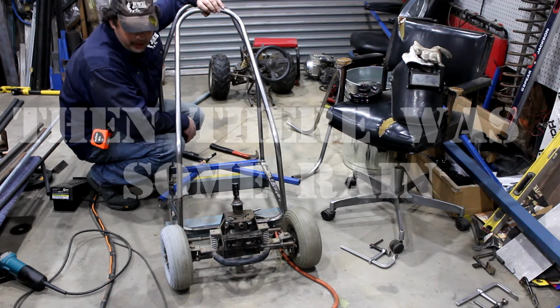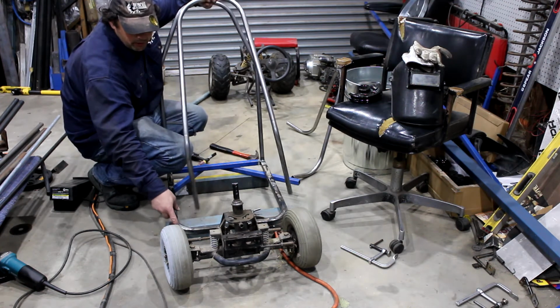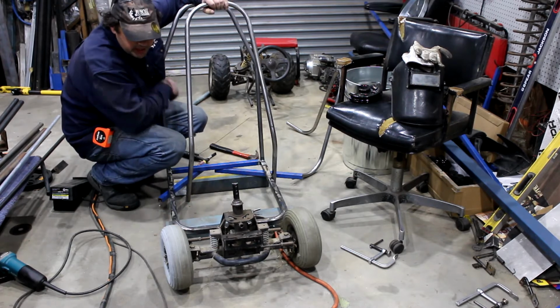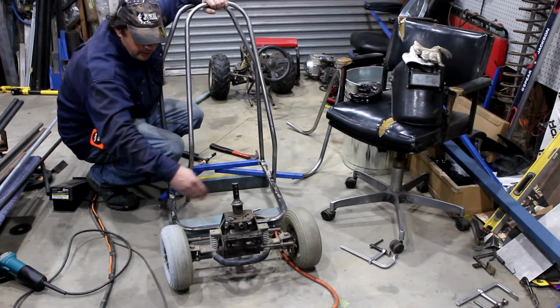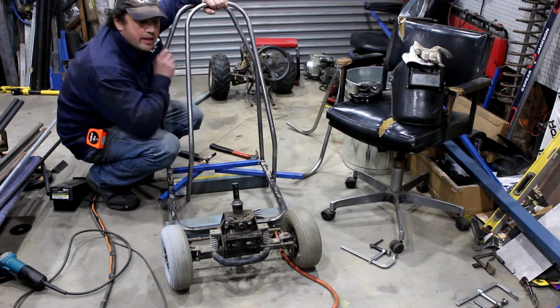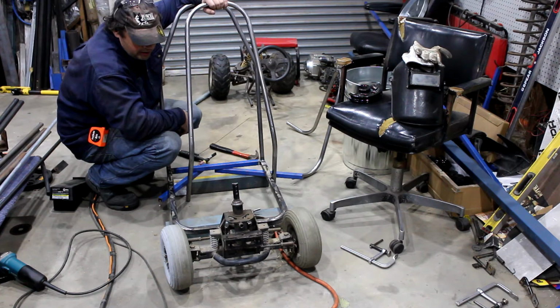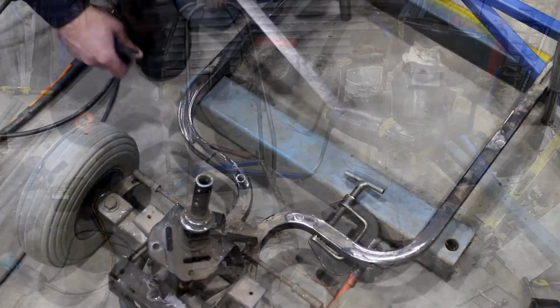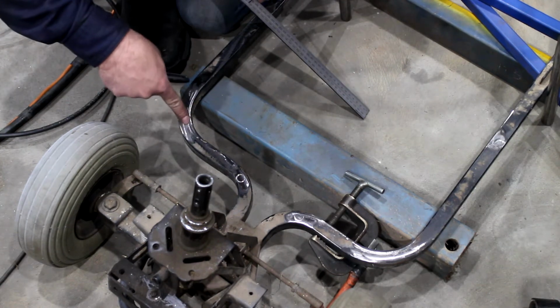So there I've got a second bar. Now, this one is landing right on this radius corner on the front of the chassis, so I need to mark a spot, put some datum lines in so I can get the same on both sides. Let me show you how to do that. So I got a radius corner and I want to put the pipe here somewhere.